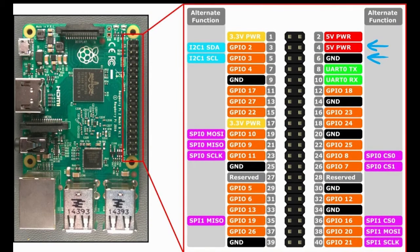On the Raspberry Pi 3, this is the pin layout, and this is how we're going to provide power to the indicator LED. I chose to utilize pins 4 and 6 on the right-hand row — that's 5-volt power and ground. The LED I'm using is a red LED with an input voltage of between 1.5 to 2 volts, so we're going to have to step down the voltage a little bit using resistors.